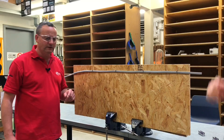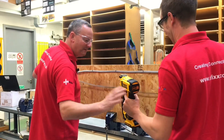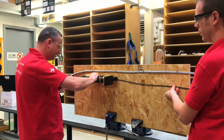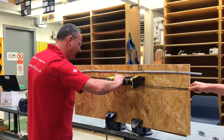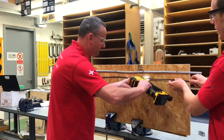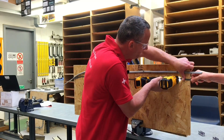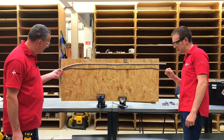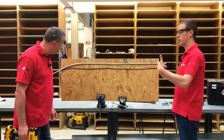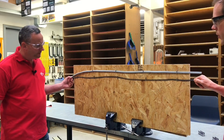Let's go to the extremities — a piece of 1mm twin and CPC. Would you like to have a go at stapling? Just so people can see a left-handed person can do it as well. The actuator didn't grab on the first attempt so the cable didn't clip — with a smaller cable you've got to sit it on top properly. Looking at this, those clips appear to have gone in exactly the same distance regardless of cable thickness, so the stapler drives to a preset depth rather than responding to the cable size. There is quite a lot of movement in the cable once clipped.